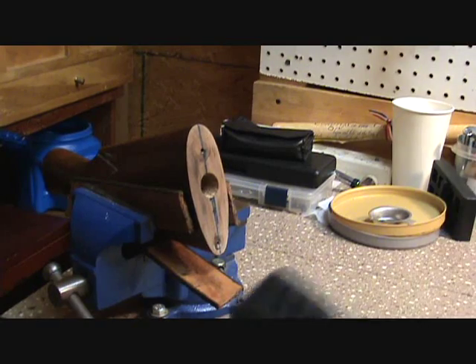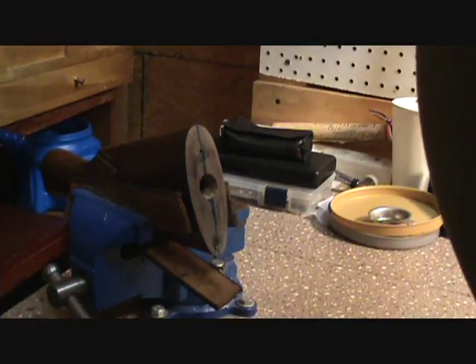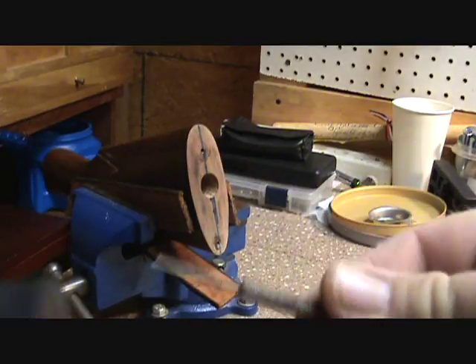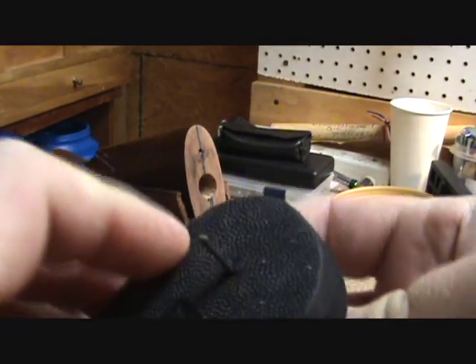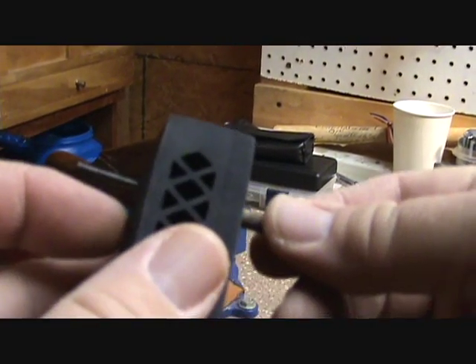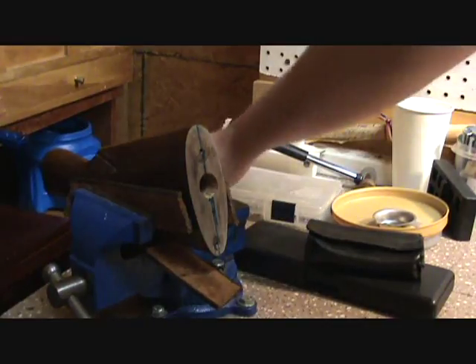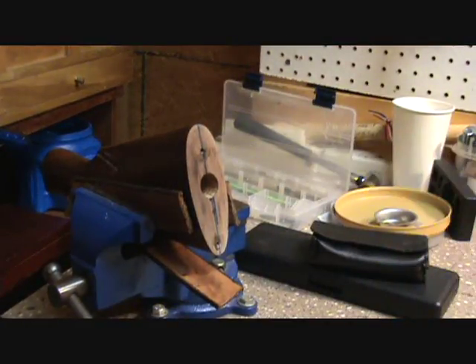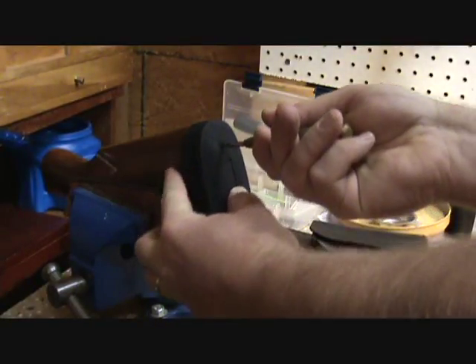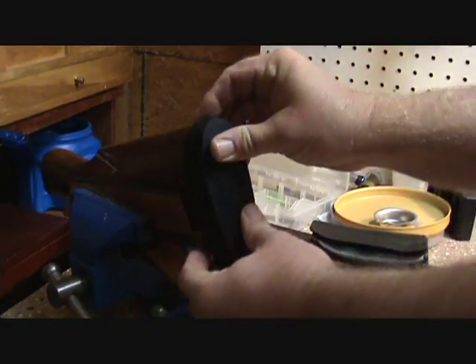What you want to do — if you look, you can see where I've put it on and taken it off — these are flat, they don't actually have access holes. So what I did was I took a really fine punch and pushed it through to mark my hole. Then I took a spring-loaded center punch, put it right where I wanted it, and that gave me access to go through the hole and put my mark on the stock, centered up exactly where I wanted it.